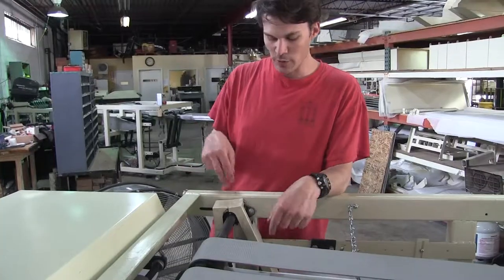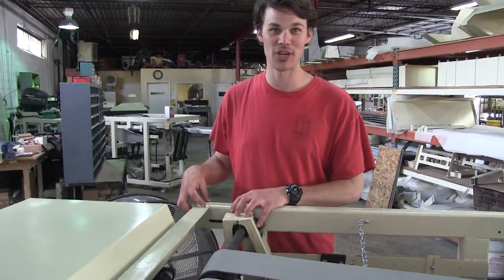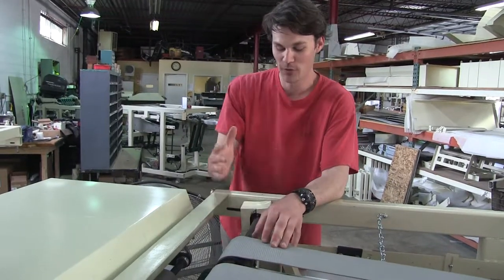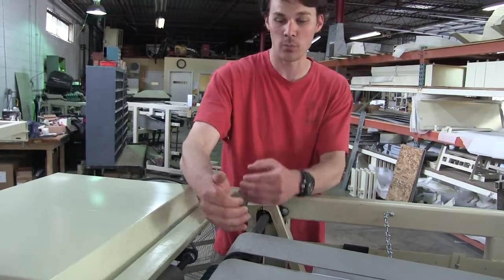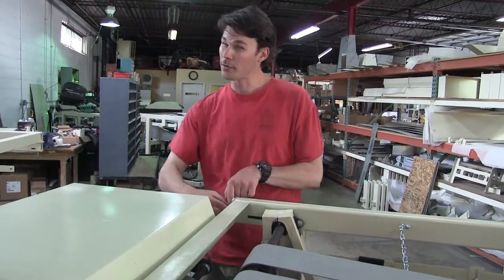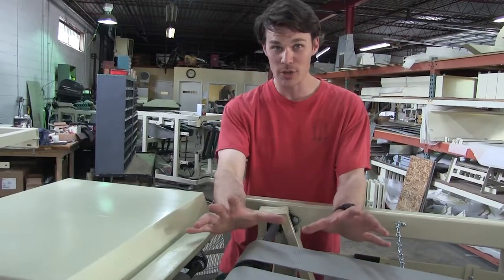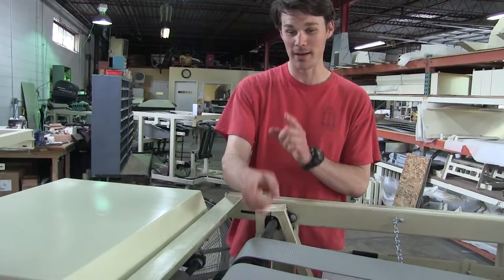Let's move on to your other problems. But real quick, before we do — a word of advice: do not make giant changes when you're adjusting this. Don't go and turn this thing twice. Make a little quarter turn on this bolt — a quarter turn will go a long way when it comes to tracking belts. Make that slight adjustment, tighten these back up, and let it run. It's going to take some time to adjust and you'll start seeing it walk. Once it stops walking, go back, loosen these two again, and make another minor adjustment — maybe even an eighth of a turn at a time. Little goes a long way when it comes to tracking belts.